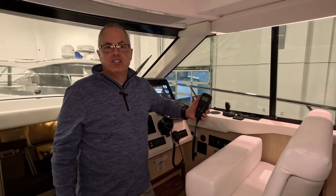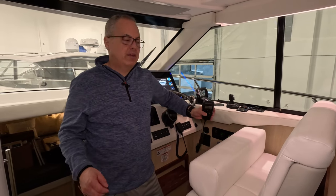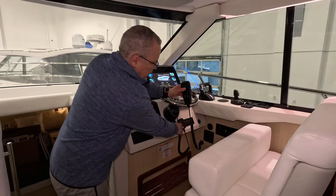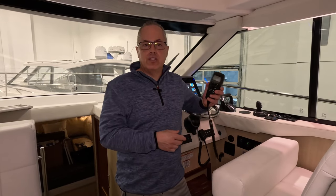The next upgrade is a second VHF radio — something I think Regal should be offering as an option. It's a huge safety benefit: if there is an issue with your primary VHF radio, you obviously have your secondary. In all the boating we've done, a lot of times you're required to monitor channel 16. But in the Chesapeake Bay, for example, because of commercial traffic, their working frequency is different. You'll want to monitor both frequencies because a lot of the traffic isn't on 16. Or if you're calling a marina, with only one VHF you have to switch over and then switch back — if the marina tries to contact you, they have to reach you on 16 and you have to switch back over. With two VHF radios, you can keep one on the marina and the other on channel 16.